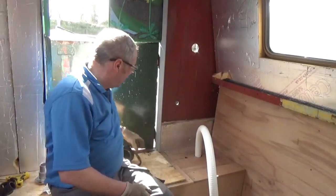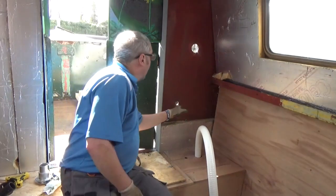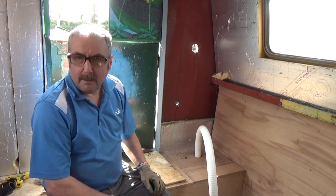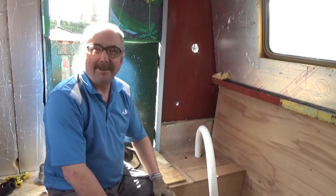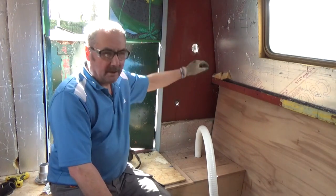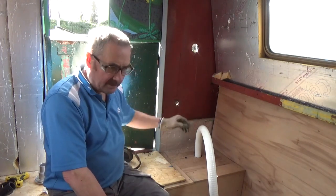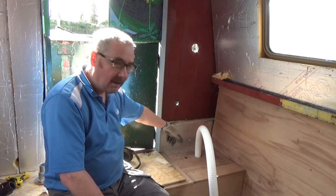File off the back - that takes off the sharp edges. So that's 6mm plate and it went through easy enough. It would have been better if I'd got some cutting fluid or oil on it, but that's done. We now need to drill and tap the holes for the water inlet - that just pokes through and tightens up on the back with a nut - and then we'll use push fit fittings and foam it up.